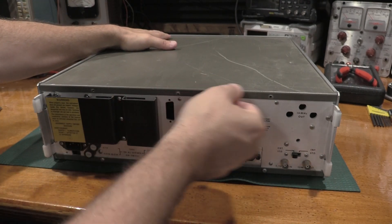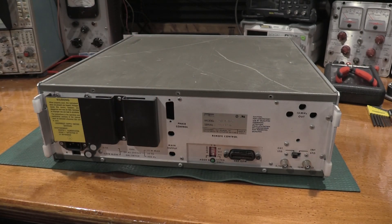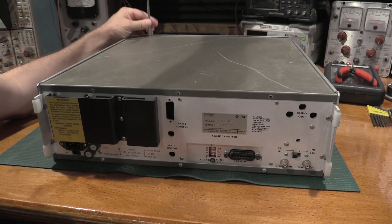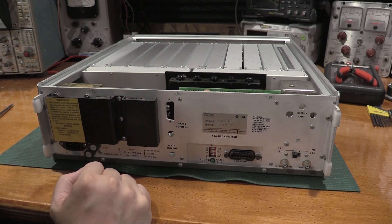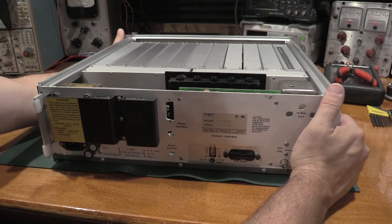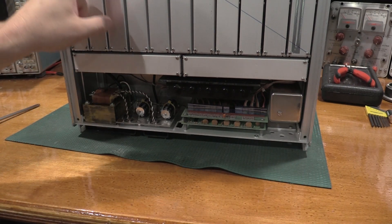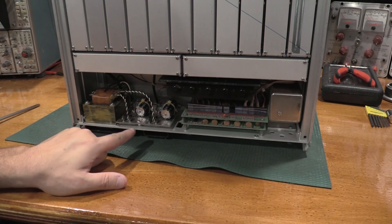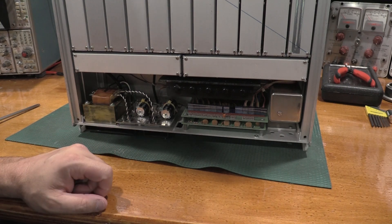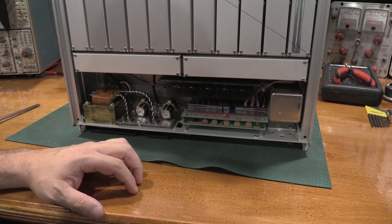Are you going to come out, or do you need some persuasion? It should just slide. There's more screws — that's why it won't come out. That is way more shielded than I expected. It looks like we even have some kind of adjustable cavity here. These are the decades — okay, that makes sense. Power supply stuff, nothing too exotic. Two set points on the power supply and some bulk filter caps. We'll check those for ESR, make sure they're okay. They don't look bad. That looks a little strange, but the lines are right, so it could be okay.